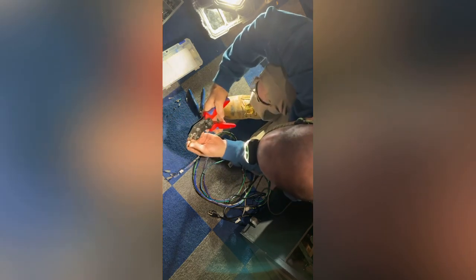At first, you fumble around, you put them in there wrong, you end up wasting some of them. So if you guys order them, or if you're going to the arcade shop and you're ordering them individually, always order yourself a bunch of extra ones. They're not very expensive, because you're going to use them eventually. You're going to screw up a crimp here and there, even after you've done it for a while. It just happens.